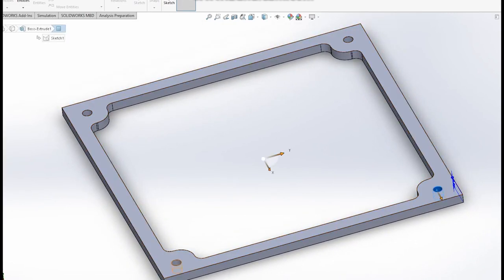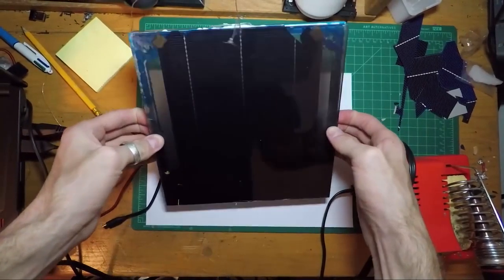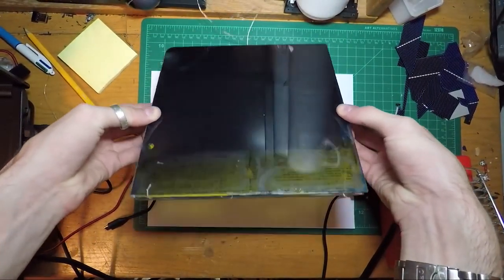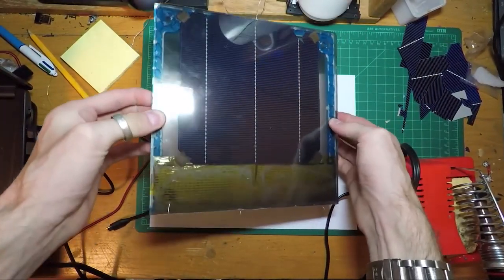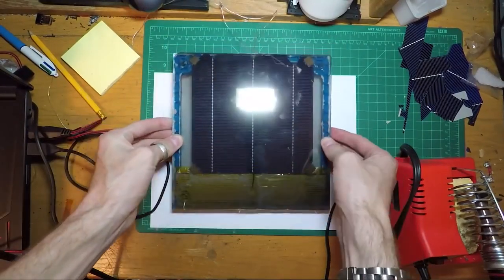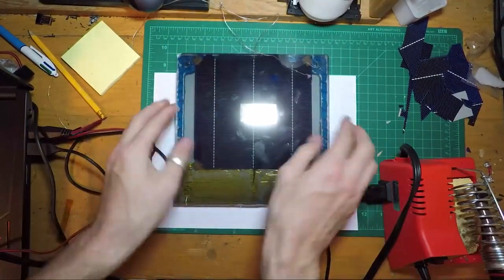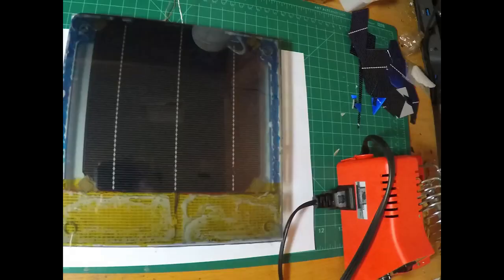Now, it is not clear what Tesla uses for sealing their cells, since we only see a bird's eye view of the houses. If we pick up the panel and rotate it front to back at an angle, we still get the same effect of the micro Louver coating. However, if we rotate it from side to side, we don't get that effect. And this is one of the key principles of micro Louvers. You can design them however you like, and this is one of the things that Tesla has used in their solar panels. A cell like this outputs 2.35 watts.